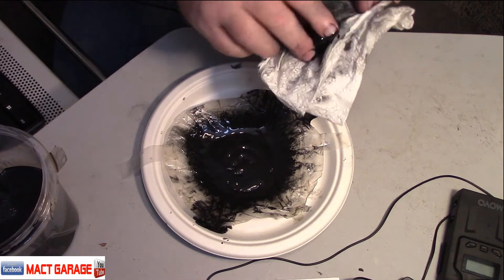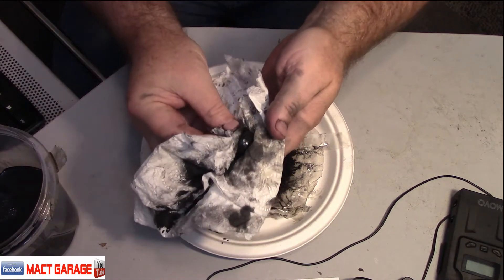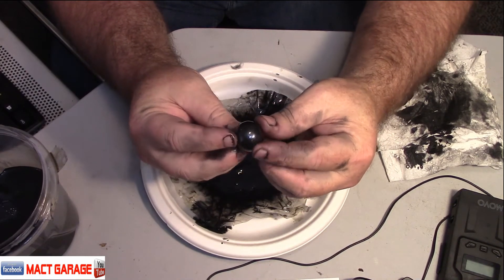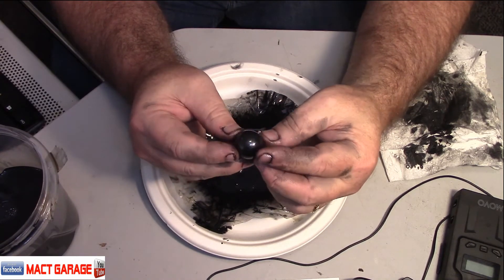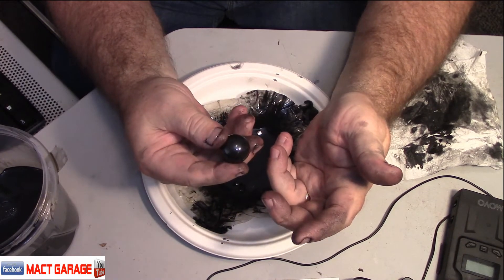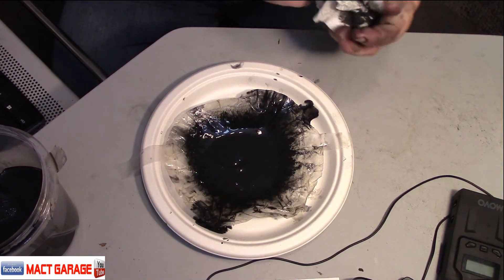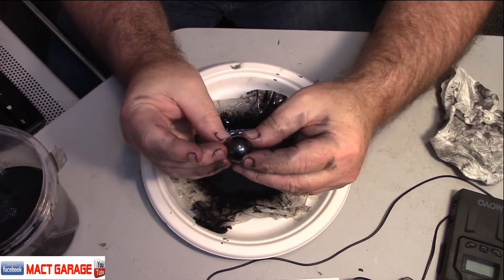Now I'm just going to try to dry it off just a little bit to see if there are any particles sticking to it. Me drying this off isn't necessarily going to show anything clearly, but what I'm getting out of this is I'm not seeing any metal. I'm not seeing iron here. If there is any, there's very little — so that's a good thing. This gear lube — the PTUs in here — are in decent shape. That's to the human eye. What do the lab test results say? I don't know. I'm not going to test this stuff because it's a mix of two different PTUs, so it would be totally useless. But what I am seeing is there's nothing on this magnet to indicate any metal.